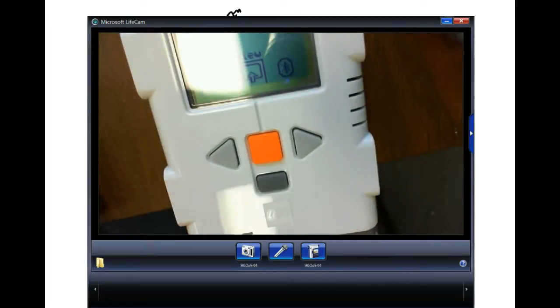Now, a sensor like the ultrasonic sensor is an analog sensor. But my program does not understand analog. It's going to be what we turn off or on. So all your input ports have a digital A to D converter on them. Now, with online programming, you can't set the sensitivity. But with offline programming, you can set what the sensor puts out to represent an on and what it puts out to represent an off.